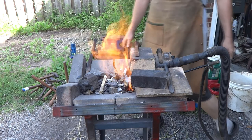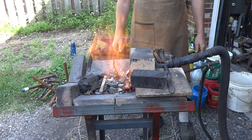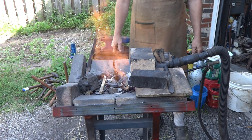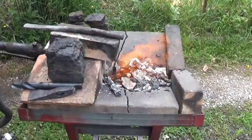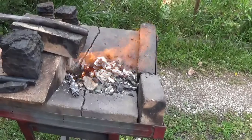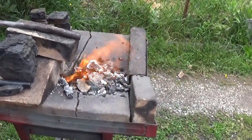So we've got the LP on right now. The reason I like to start with the LP is we have a lot of coal and charcoal that gives off a lot of sulfur and smoke, which we don't want. We'll let that get started and then kick some air on — add oxygen to it and it'll get the fire a lot hotter. Now we have the fire started, the blower going, and the LP gas going. I'm going to get some of the charcoal started, some of the coal, and then some of the coke — which is burnt coal from the last session. We've got a nice bed of coals and then we'll start heating things up.